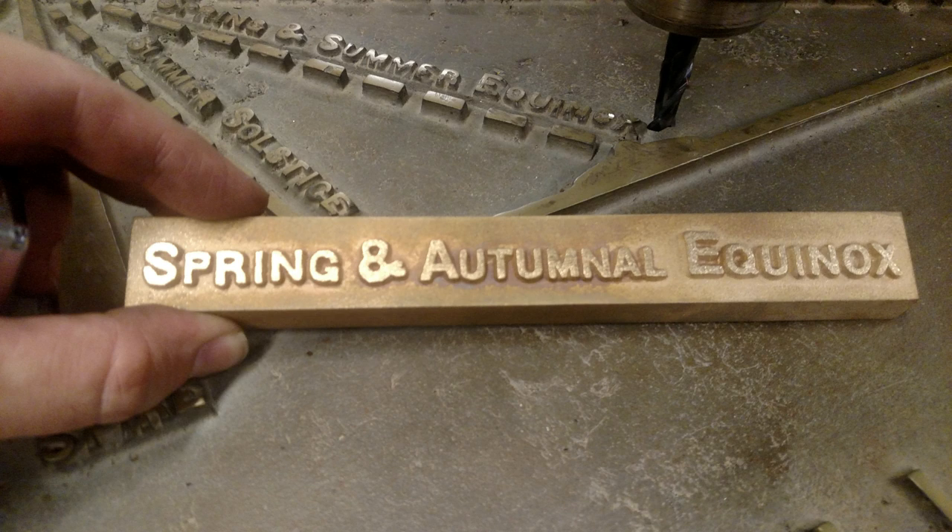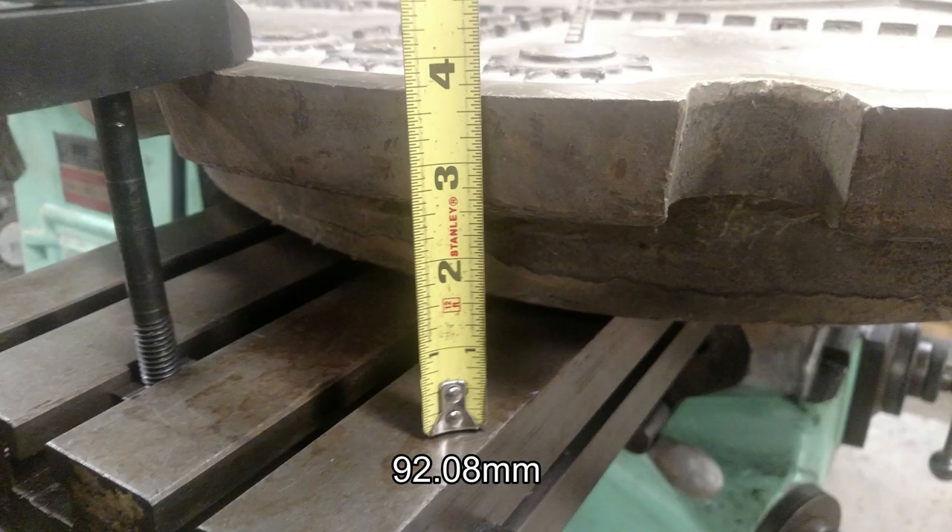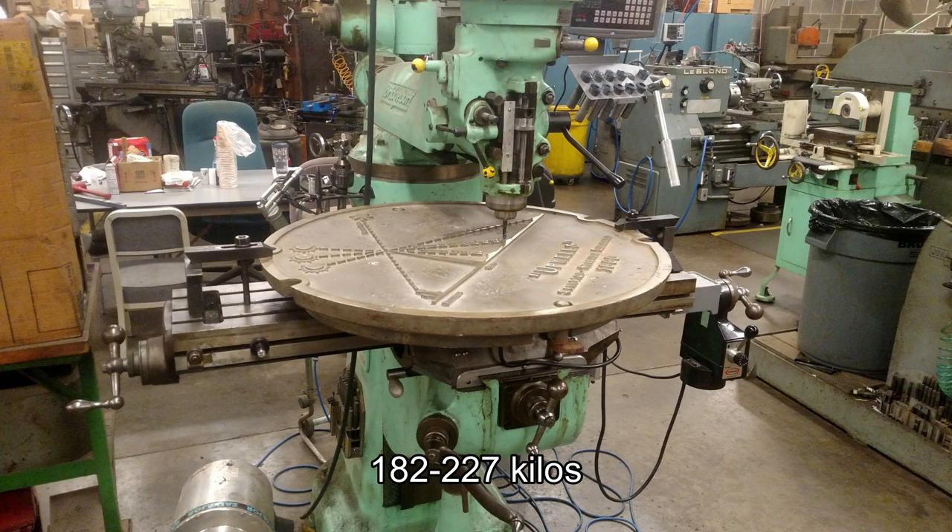To fix this we got the correct wording cast into a separate piece, which was bigger than what we needed so we were going to machine it down later. Then I machined off the offending wordage and cut a slot down into the manhole cover that the new piece would fit into once we got it machined. We did look into replacing it entirely but were quoted about $33,000 US to do that, so we politely declined. This is a big manhole cover — 31 and 13/16 inches in diameter, 3 and 5/8 inches tall, and it weighed somewhere in the neighborhood of 400 to 500 pounds. About all you could put on a Bridgeport table.